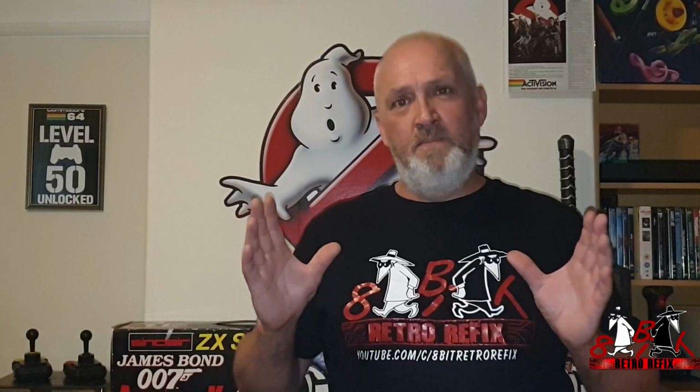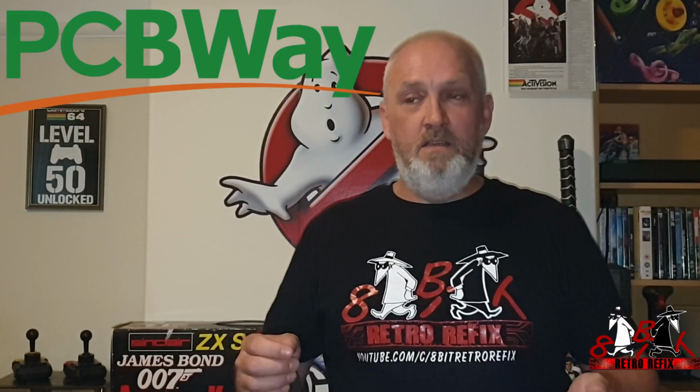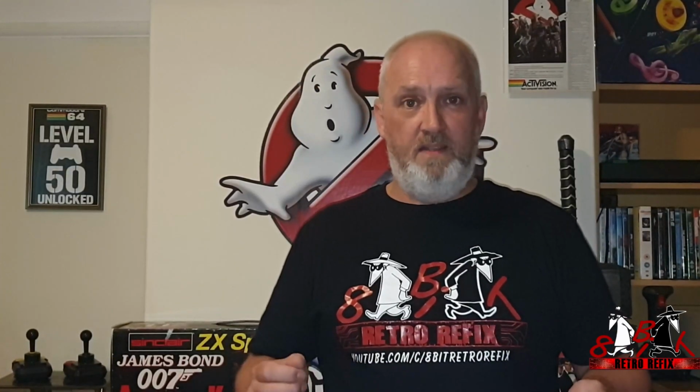One of them I really want to keep as an original as I possibly can. The other one I want to convert to PAL. I have bought an NTSC CPU board in the process, should I say in the meantime, so I can get that installed there and revamp the SX64 and make it good. Once Rob releases the board for the CPU board, I'm going to have that made by PCB Way and install that. I'm going to remove the old CRT because it's NTSC, and I'm going to put an LCD screen in there. And Adam Kane is going to update the power supply for us, so it's on UK power supply, so I'm not having to use an inverter.